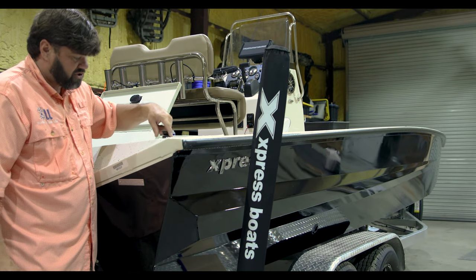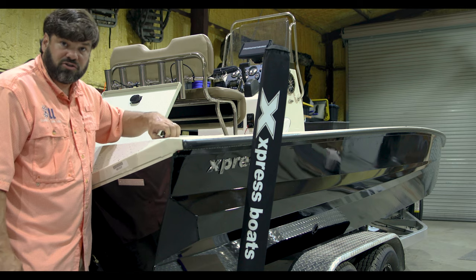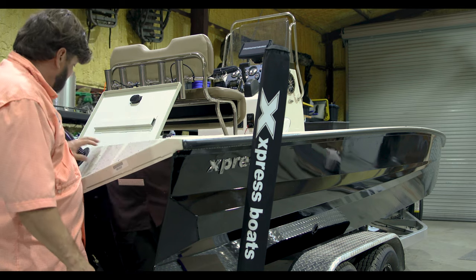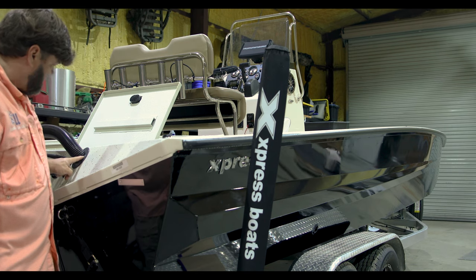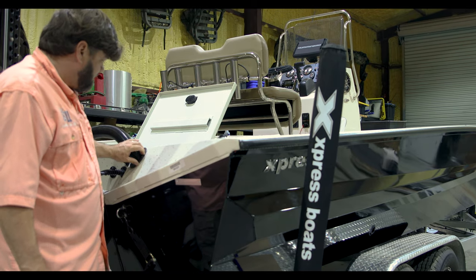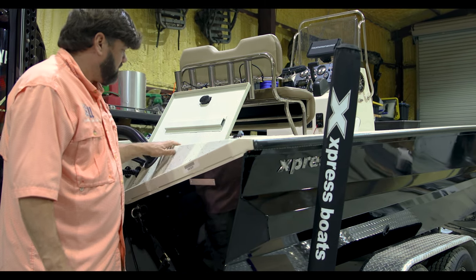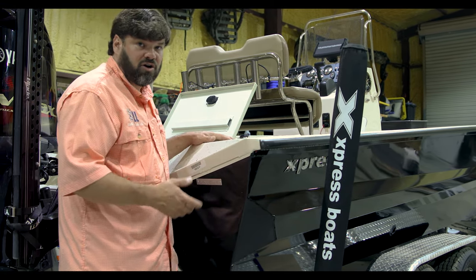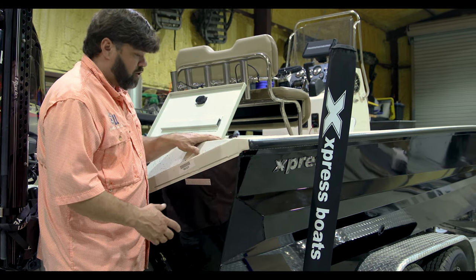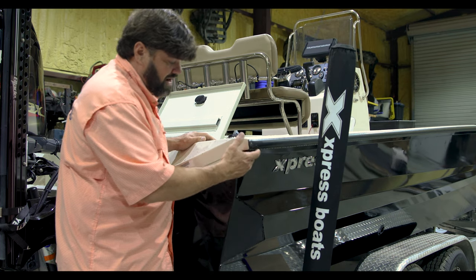Sometimes we have an anchor stern light right here. You can unscrew this, take a peek in there with a flashlight, see what you're dealing with. There's also access right here where the engine wires go in. We unscrewed this and looked in there. Use every access you can to determine the situation you have. We determined that this is fully open, so we're gonna drill a hole right here.